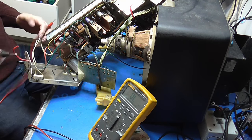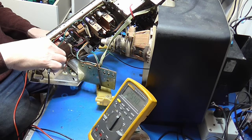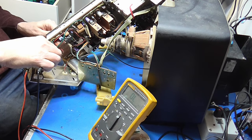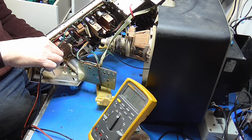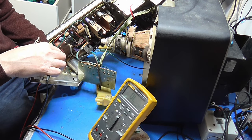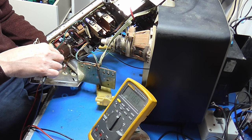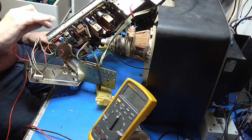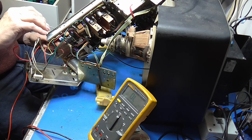Nope. So, have we got something that's holding this on? Which was HT? HT was pin 4, wasn't it? Just go back to the capacitor there. Millions of ohms, hundreds of K. So maybe our transistor is not stuck on.